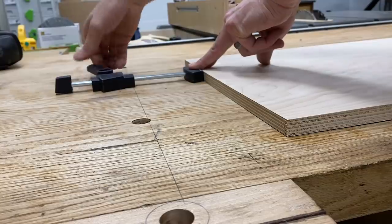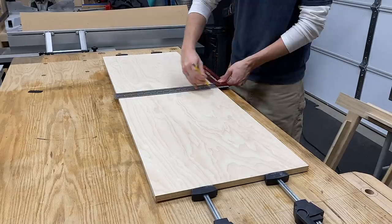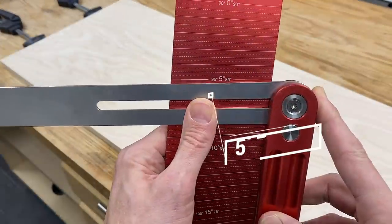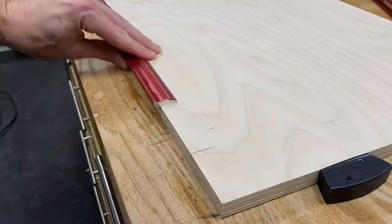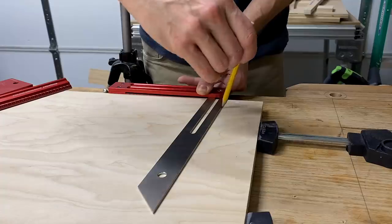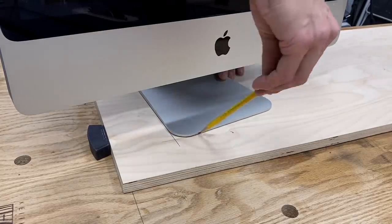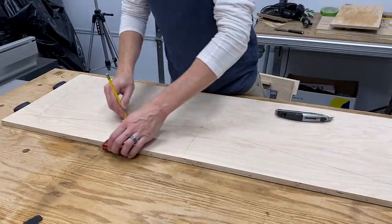Here we go again. First stop on this one was Templateville. I grabbed a scrap piece of plywood, laid it down, and just kind of laid out all my measurements. The center mark first, and I grabbed my bevel gauge because I want the ends of this to kind of bevel in about five degrees. Then I can mark out both ends, and I use my iMac monitor just to get the radius of the corners that I wanted, and then a little more layout to get the shape I was after.